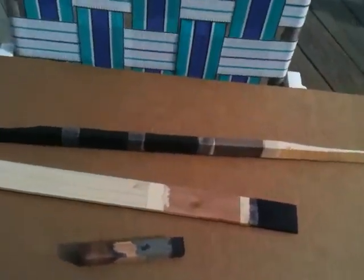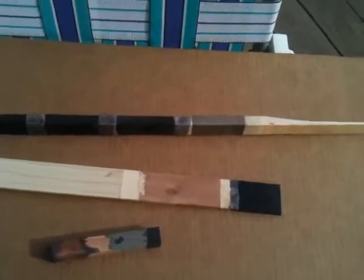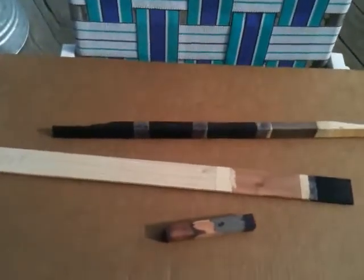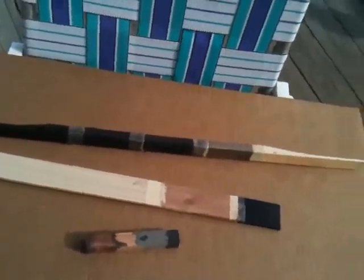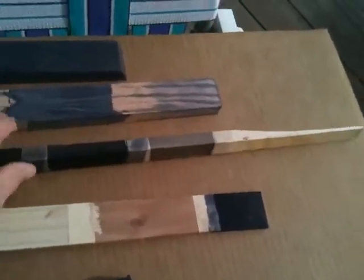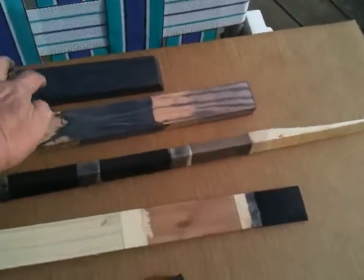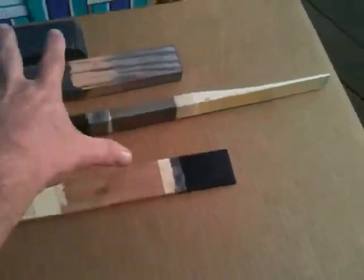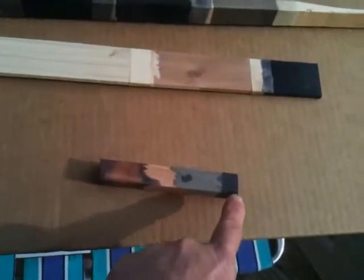So it's great to play with. Now knowing what I know, ebonizing woods is going to be real easy. I'll say it right here and right now — there are no wood stains applied to anything here. It's all the iron supplements on this, or the vinegar and steel wool on that, and the iron supplement with the tannin on this one. Might give you some options and it's fun to play with. I'll talk to you guys later. Thank you. Bye.